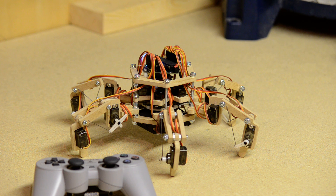The entire robot is controlled by a single ATmega 1284 chip running at 12 megahertz. That includes the PWM generation for the 18 servos and the three status channels, the RGB status light, the actual inverse kinematics calculations, and of course the actual controls itself.